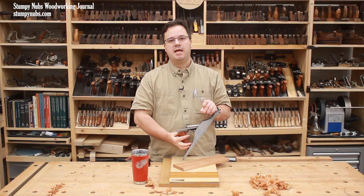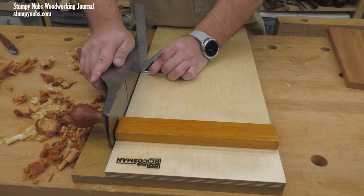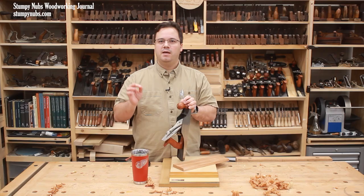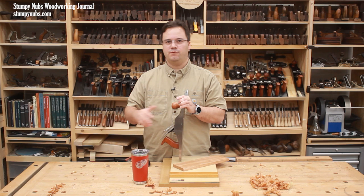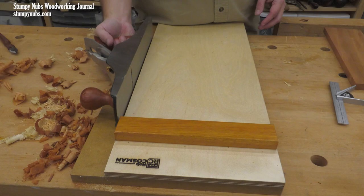Now, let's talk about the plane itself. The side of the plane that lays on the shooting board has to be square to the sole of the plane. As it lays on the board, I should see no light between it and my square. If your plane is slightly out of square, you can compensate by canting the iron in the throat using your lateral adjustment lever. But then it is going to be out of alignment when you want to use the plane apart from the shooting board. So if possible, I would dedicate a plane that needs that type of adjustment to the shooting board so I don't have to adjust it back and forth. You can also try to correct your plane by sanding on the side — there are videos and tutorials out there if you want to check into that.